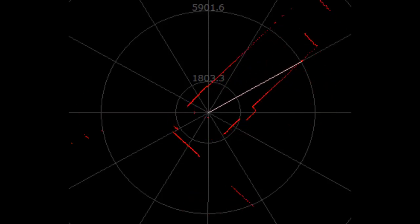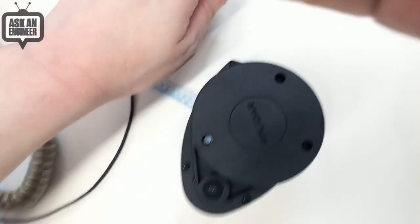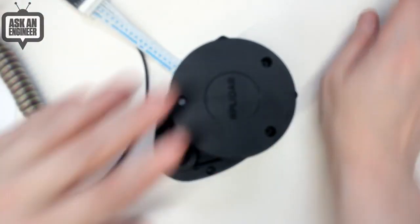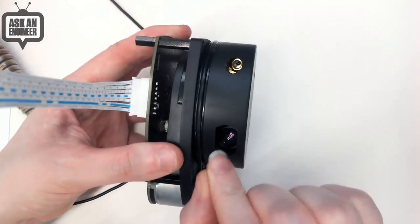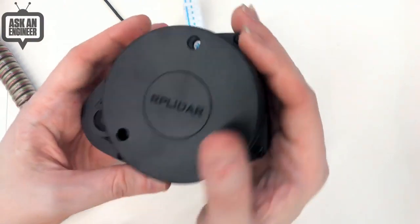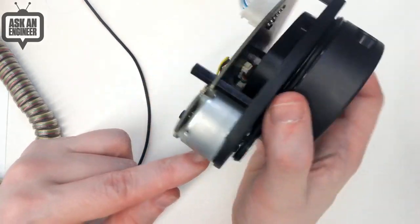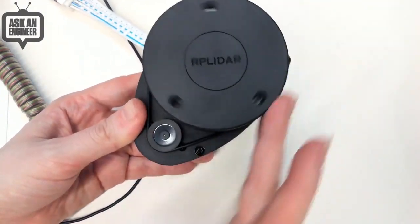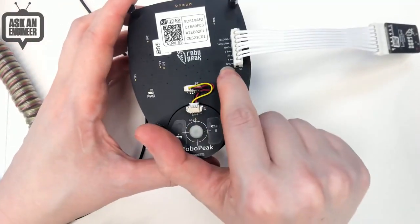You can raise and lower it with a servo or stepper if you want 3D mapping. What's nice about lidars is they're extremely precise — you get about 0.2 centimeters of accuracy with these. Some lidars don't rotate, they're just a fixed sensing element. With this one you get both the sensing element — a little laser and a detector that detects the bounce-off — and it spins. There's a motor and a hall effect sensor so it knows where it is, giving one-degree accuracy as it spins around.